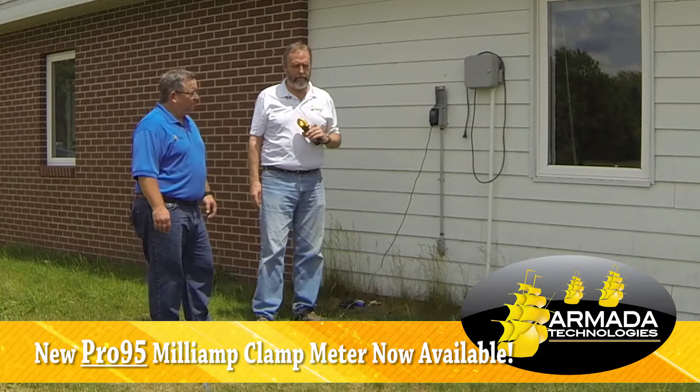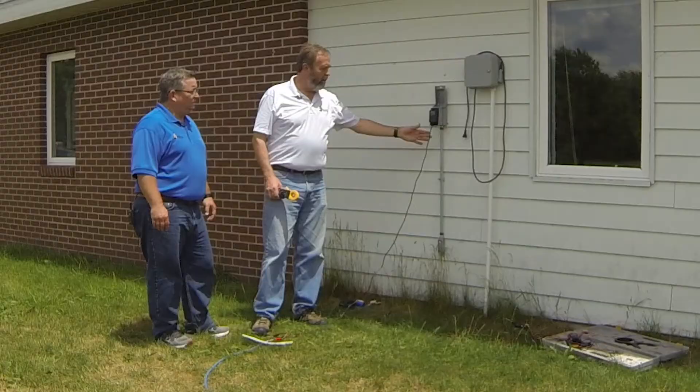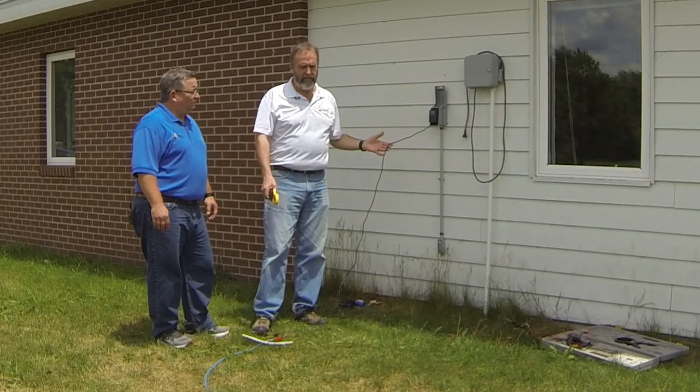What we've done is laid out some maxi cable with a couple of Rainbird decoders on them as examples. This could just as well be a Hunter IDC cable with Hunter decoders and other vendors, but we're going to use this for illustration today. Since we're always troubleshooting the cable out in the field, we have no controller connected. Instead, we're providing a 24-volt AC power source, which gives us a much quicker and easier measurement of the currents flowing that should be normal in the cable.